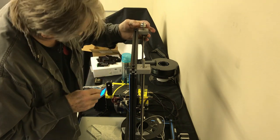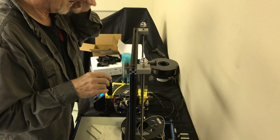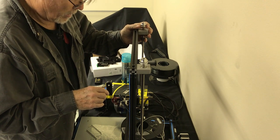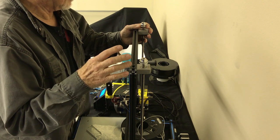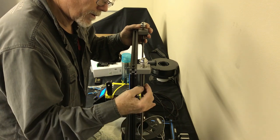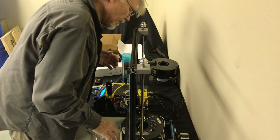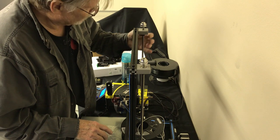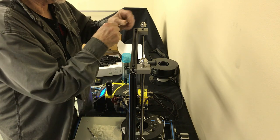we put these pulleys on what some people would consider upside down on here. And we're going to have a little shaft sticking up out of here. The reason we have that is we still have some adjustment if we need it. If you want to cut it off later, that's fine. This one you can actually adjust down further with the set screw. This one, I think the motor's adjusted all the way up on here, so I think you'd have to actually cut on this particular one. So, all right, we're going to pull these down,